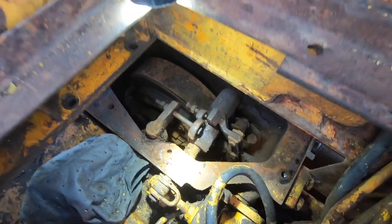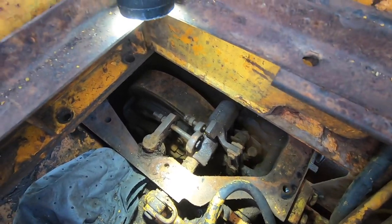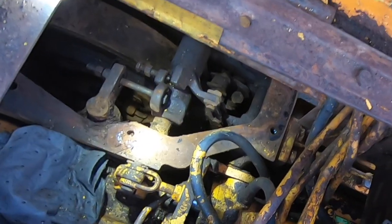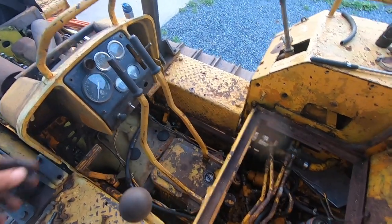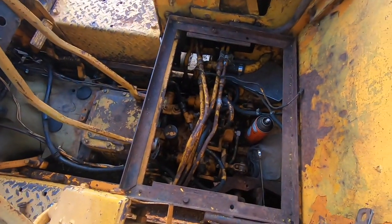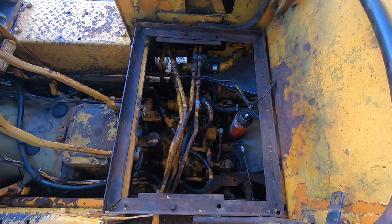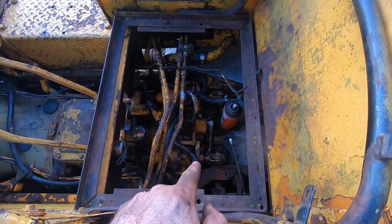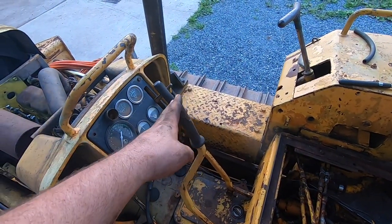It was just seized up. So I'll continue to free that thing up and get my ratchet back. Come on. The other thing I'm working with here is free play on the lever, right? If you look at what's happening here, there's no action happening at the clutch. This is all slop in the system. So I'm gonna make some adjustments down here on the power steering linkages to pull some of that slop in.